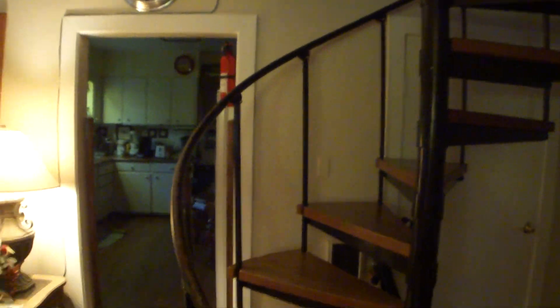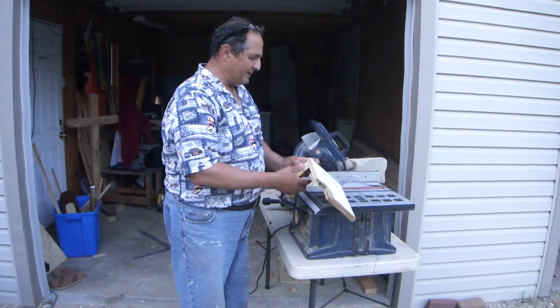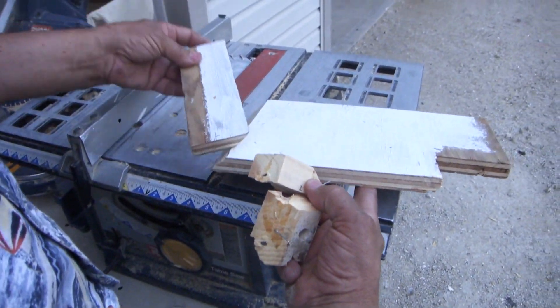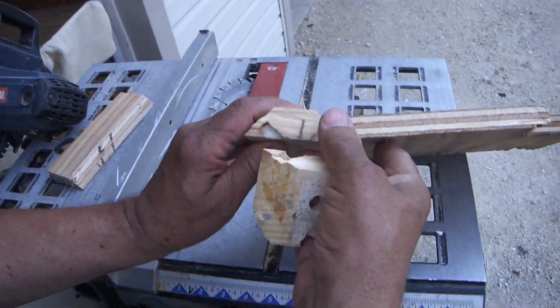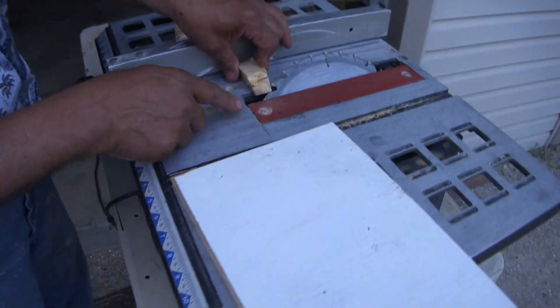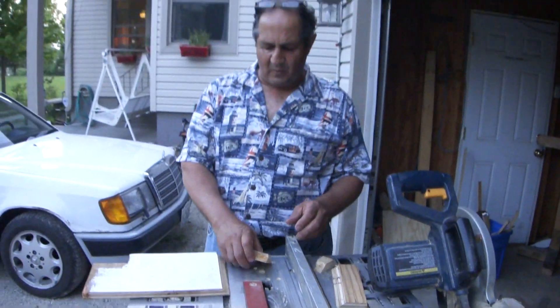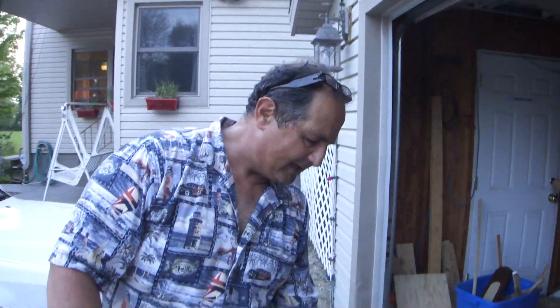I'm going to go into the garage and make a new one of these pieces, a lot stronger, out of plywood. I've got a piece of three-quarter inch plywood at my table saw. I'm going to copy this piece — I've already got one cut to get rid of the scrap. That's my first cut. Then I'll measure and put it through. I'm going to make my piece slightly smaller than the original so we won't have to countersink the screws — making it smaller pushes them in closer.